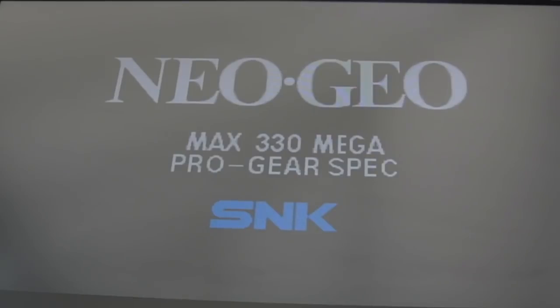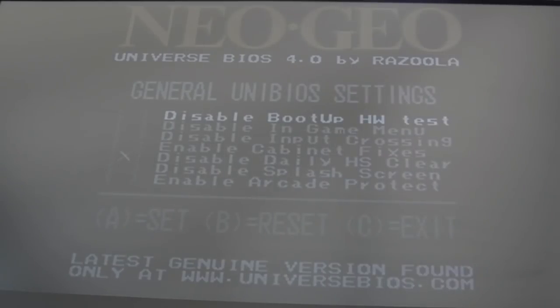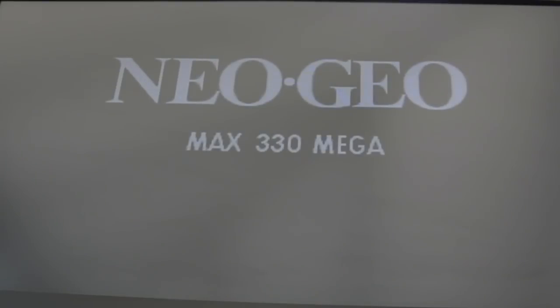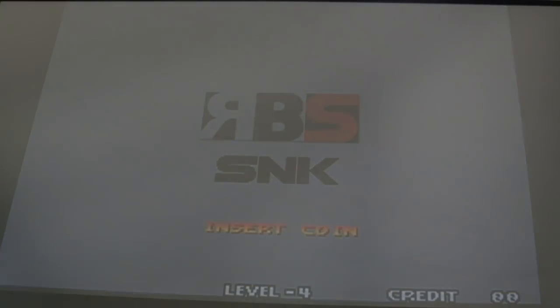Right, I'm just going to reboot that. We'll enable the self-test, because it's probably off. Just hope we don't get a clock problem. Nope, there we go. So the clock problem is resolved. After all the testing I've done, it seems to have been resolved after we've reflowed around the HC32 there. So I'll just wait for it to cycle to the other slot.